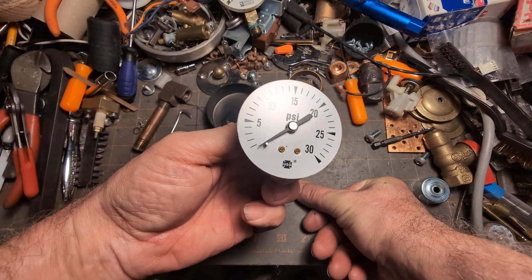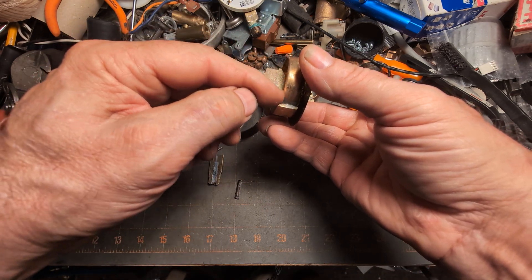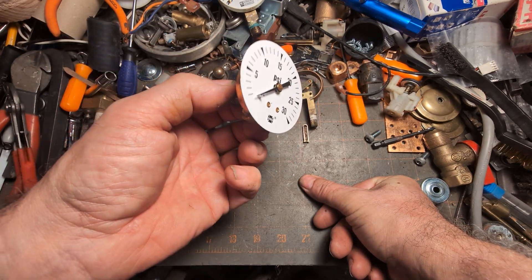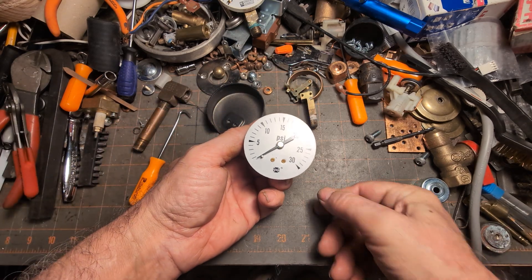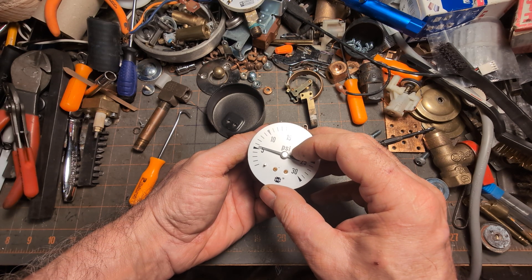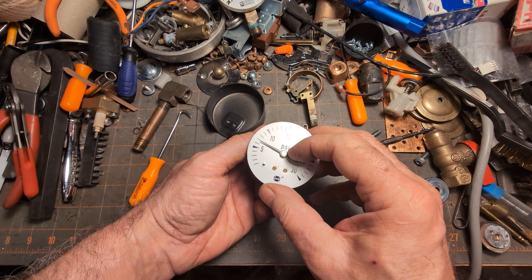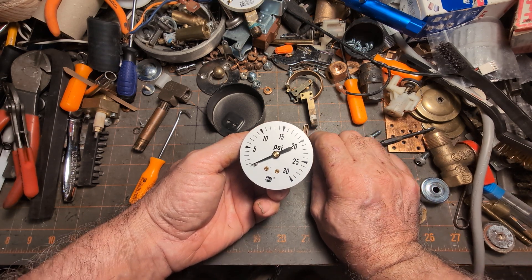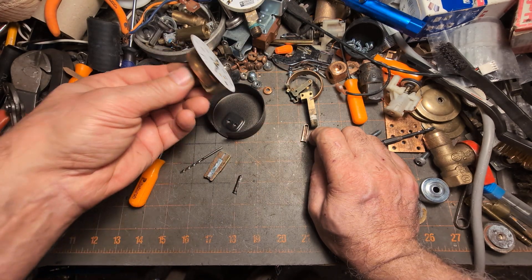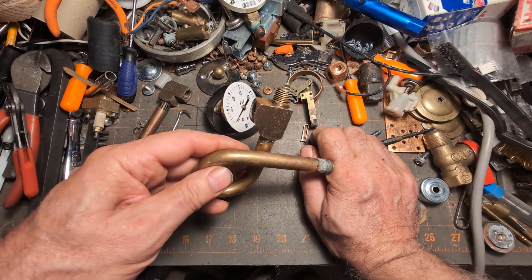So this is also an internal siphon gauge — sometimes they're labeled, sometimes they're not — because the water can get trapped in here, but also dirt and so forth, and you won't be able to get it out. A lot of times you'll see these gauges where the boiler won't even be on and the pressure will be reading something and won't move. It may drop a little bit, it may go up a little bit. But once you see a gauge that's stuck in some position, that usually means the gauge has failed or the internal siphon is blocked. My advice would be to figure out a way of removing that and putting on a proper steam siphon.